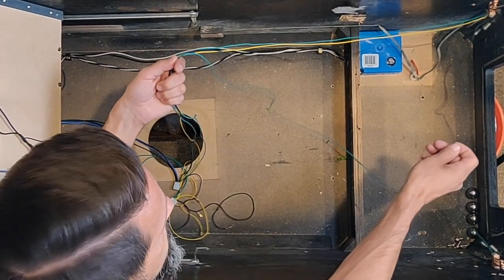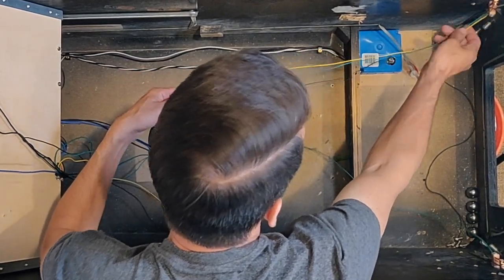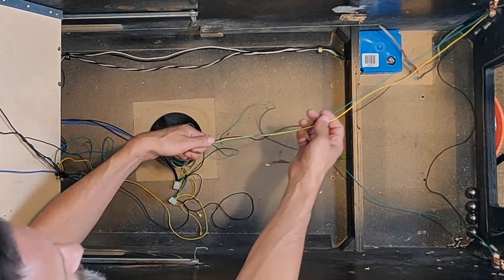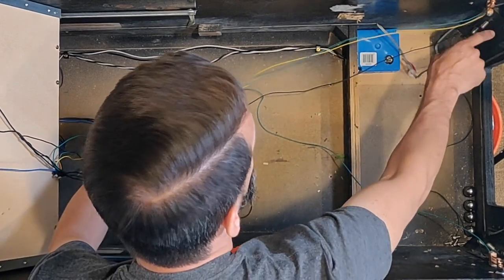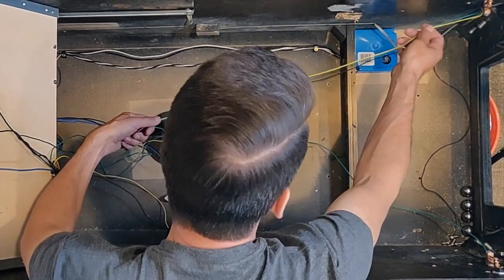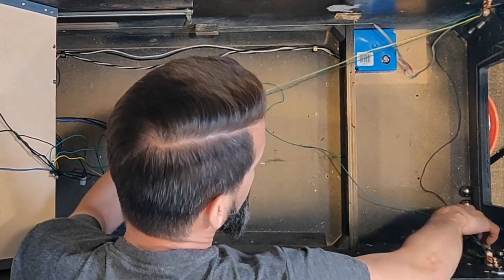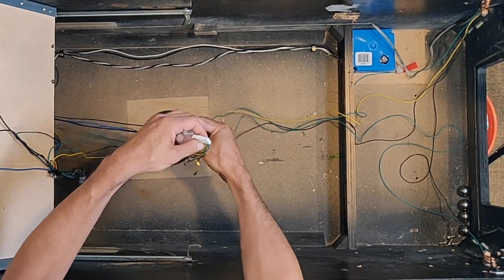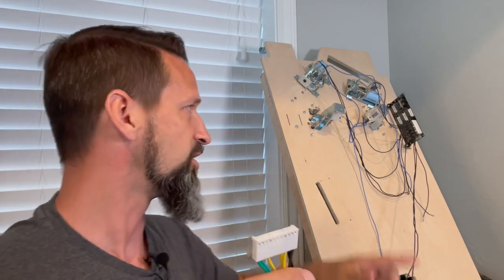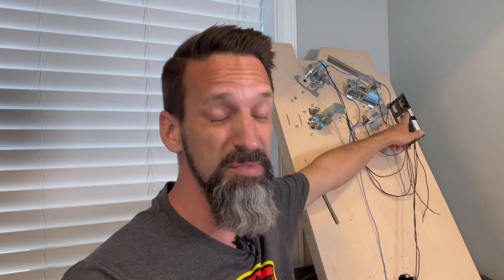So that's my black wire, and then I've got a green wire going to each switch. On the right flipper button, I've got a two-stage flipper leaf switch in here because I'm gonna have an extra flipper button on the extra flipper on the right side, so there's two wires, so it knows when each one of those contacts gets closed, all right? They should both be green, but I ran out of wire. So we got two switch wires here, one ground, and then from the left, we've got a green for the switch, and then another black for the ground. Those would typically go straight into this guy, and this guy, I'll throw up the diagram, goes into our I/O board up here, on the first set of switch inputs. Remember there's 32.